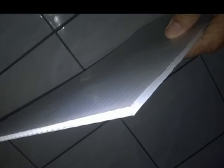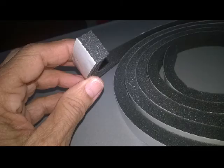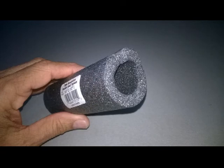The metallic part of the windows can be covered with coroplast, a kind of corrugated cardboard made with plastic material. To insulate the door frames, a special adhesive tape is required. The gap on the bottom of the door can be sealed with rubber foam, usually intended for pipe insulation.